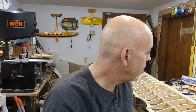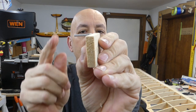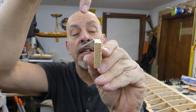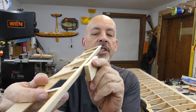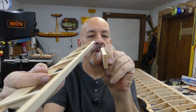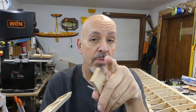Once that's drilled through, it's going to be right up here at the top. When you slide the hinge through and put it into position, it's going to stand just a little bit proud. So say this was the aileron and this was the wing — the aileron is going to get drilled, because I have to make all the marks first, and that's going to be the next step. All of that will get drilled through, with the hinge sitting at about that angle, with that gap on it, coming down through the aileron.